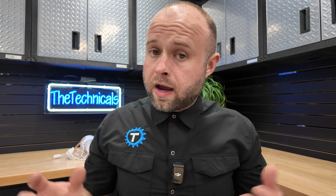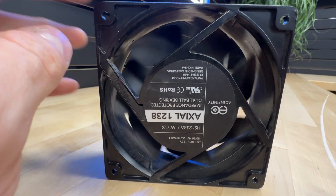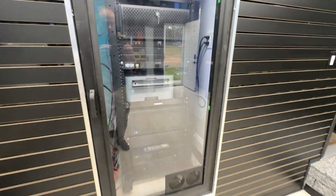For fans, I ultimately decided on a four-inch inline fan. I have a 120-millimeter axial fan, but it seems unable to build enough pressure to really force the air through. And these USB-powered 80-millimeter fans are really low volume — they're better suited for cooling my server closet. If you're keen on attempting this along with me, links in the description below to all the off-shelf products I purchased and all the 3D print files I created.